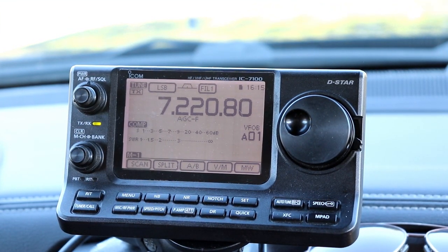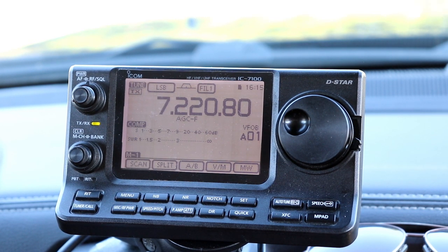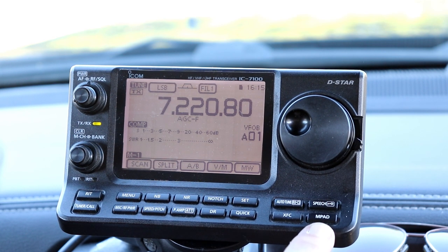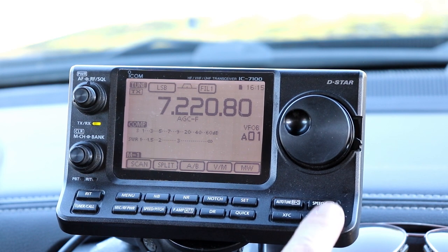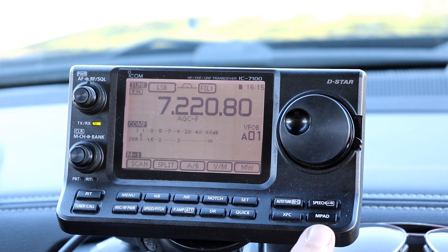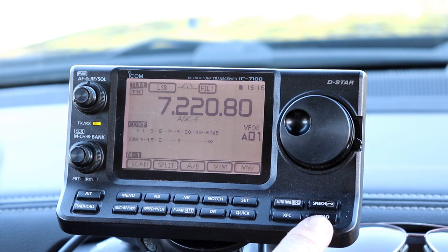So, let's say you're tuning around the band and you want to remember a couple of spots where you've heard signals, but you want to go back and catch up on those in a few minutes. But you don't really want to program them into a memory. Well, there is another set of memories built into the 7100 called MPad Memories — it's this button right here that says MPad on it. That is MemoPad Memories, and it's a set of either 5 or 10 — your choice — of memories that allow you to just quickly store something and then cycle back through a group of them to find signals.